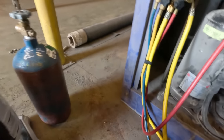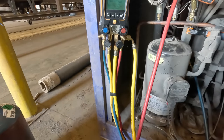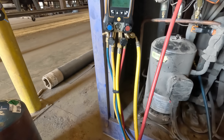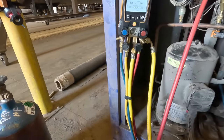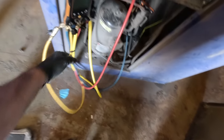We'll go ahead and do our subcooling here — clamp over to our liquid line. We're on the discharge line and there's going to be an itty-bitty amount of drop across that condenser coil — five pounds, maybe 10, but more likely five. Not too worried about it. It's cycling on and off and actually shutting down — it's at set point a couple of times. Running a 46-degree superheat, 13.8 subcooling — that's with the fan not running currently. We do have an error code here, something about the drain. There goes the fan again — kicking on at about 235-240, so about 100 degrees. That's not too uncommon from what I'd normally see. And subcooling drops down there.